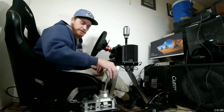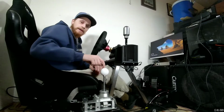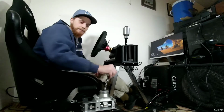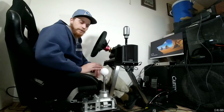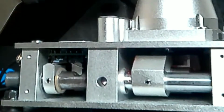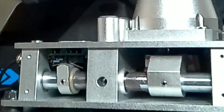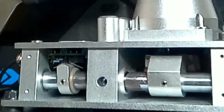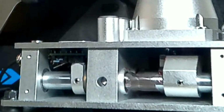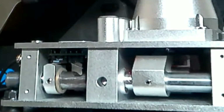This is using micro switches. I'll include the link to the disassembly of this Simvertex shifter in the description below, so make sure and check that out. But a couple people mentioned that's going to be the downfall of this unit, the micro switches, which are super solidly soldered on there. The solder work is great, and the components that they used are, in my opinion, top notch. I believe it will be very easy to desolder them, whatever the word is, and pop a new one on there. I really do. That being said, it is an inferior technology, being that there are more parts touching.